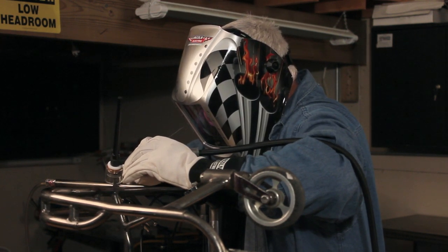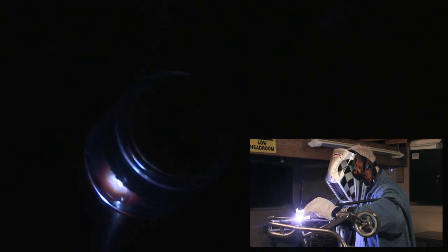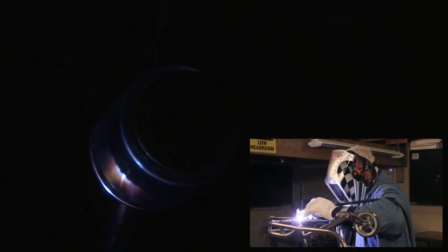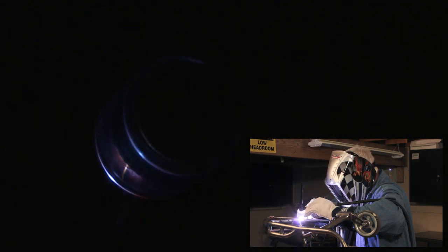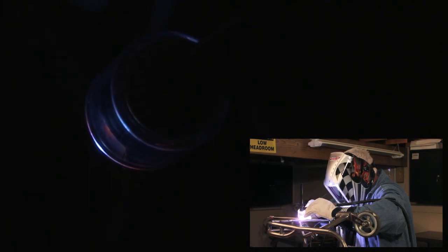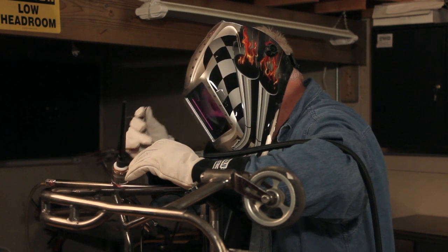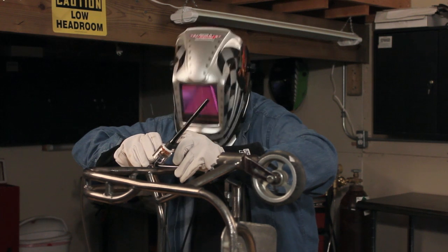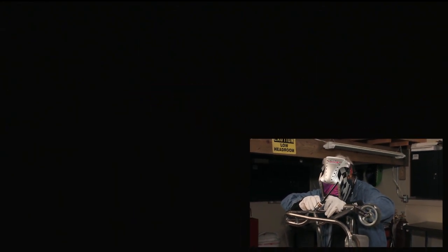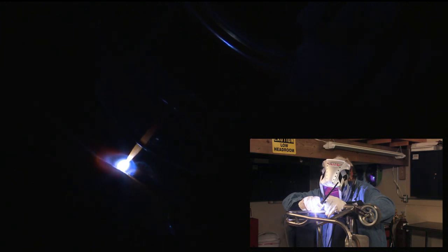Turn the pre-flow again — got argon on there. Dabbing, hitting filler — welding very nicely. I'm getting a little out of position, so I'm going to fade out and stop. I'm terminating this weld, and I want to make sure I've added enough filler at the end, because that's where cracks typically like to propagate. So I'm adding a little extra and rolling the edge.